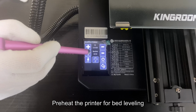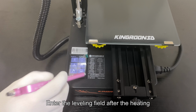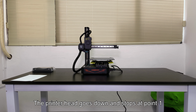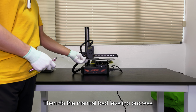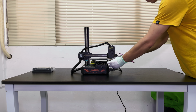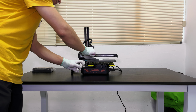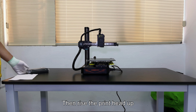Preheat the printer for bed leveling. Enter the leveling field after the heating. Click point 1 to start. The printer head goes down and stops at point 1. Then do the manual bed leveling process. If you don't know how, please check our channel to see the tutorial. Then rise the print head up.